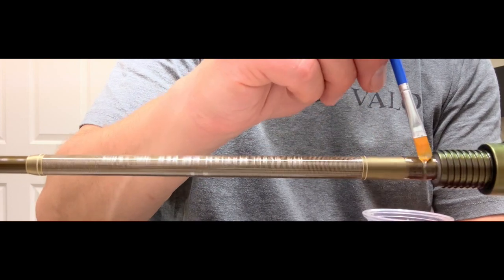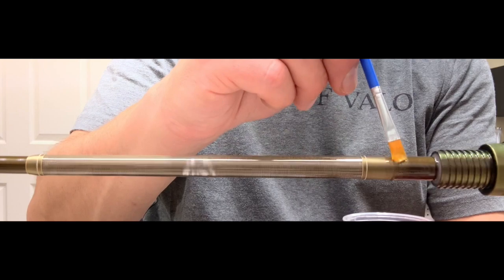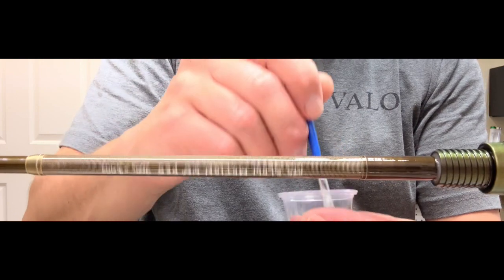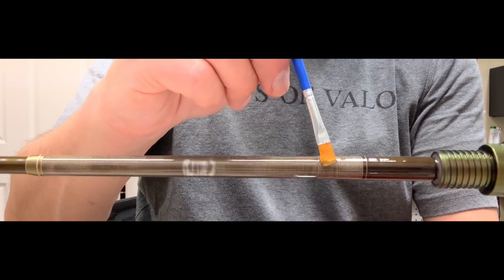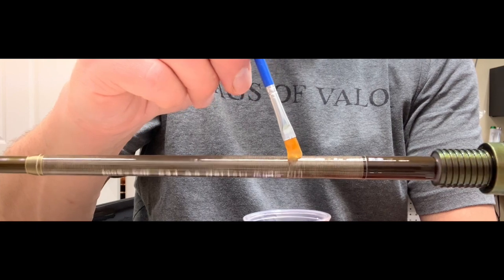Beautiful color from them, custom paint job on the seat. And here I go. So we've got our finish mixed, and I'm using the brush, and I'm just slowly putting it on. I'm putting a heavy, wet bead, if you will, and then I back up and go a little behind where I last applied finish and add some more. And I'm just doing this to get it really wetted out and even.